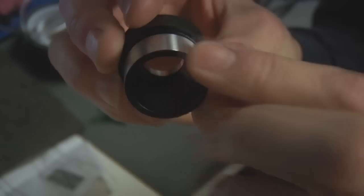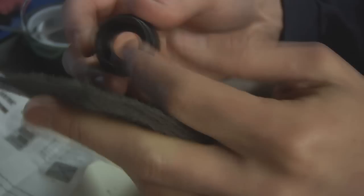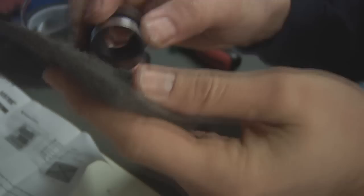It's a little bit of crustiness here around the edge, which I can probably clean up. I've got these Scotch-Brite pads that I bought by the caseload, and these are great for getting your aluminum ready to do the powder coating, but they also do help a little bit with cleanup after the fact. Powder coating is very hard. It's a very, very durable surface, so hard to find an abrasive that will help you clean it up, but that seems to work pretty well.